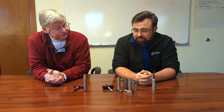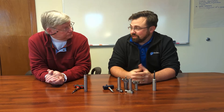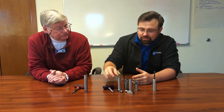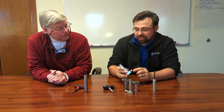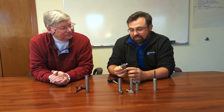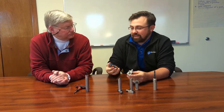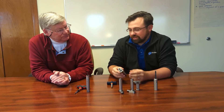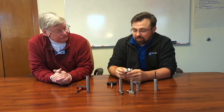Moving on up to the hydraulically actuated system — this is a neat way to go, where again we're still not using ER tapers to hold the drills. This actually uses internal oil inside the holder itself, actuated by a hydraulic piston on the backside. One of the real big benefits here is the ease of tool changing — using an Allen key on a torque wrench with torque limitation, which prevents over-tightening and gives you the same exact precise setting every single time.